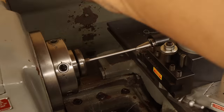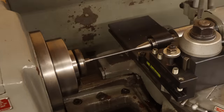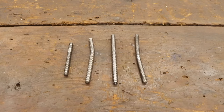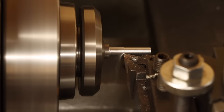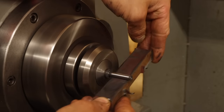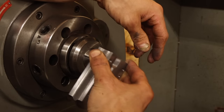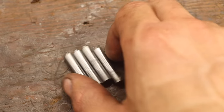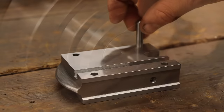With a fresh set of brain cells the next day, I can take another stab at this. I'm triple checking the diameter before I start cutting, and only taking a couple thou off at a time. But right when I start to get close, it snags again. I clearly need a break from this part of the project. Let's work on something simpler, like these straight pins. They're very basic with only one critical feature — they have to be a friction fit with the reamed holes we put in the block. Turning these down to 2 thou oversize gives me the material to smooth out the cutting ridges and very gradually approach the tight tolerance I need. When I get close, I trade measuring for simply checking the fit with the block until I'm happy. Then part it off and make three more. Last step is to clean up the other ends and file a nice round on each end and sand them smooth.